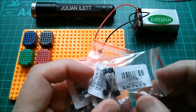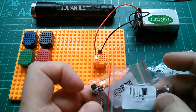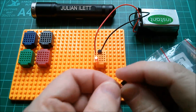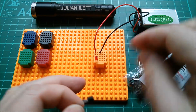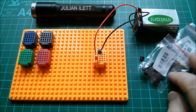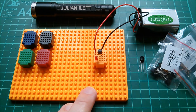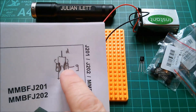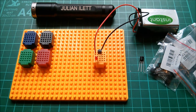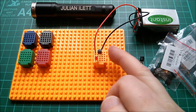I bought three types of JFETs: some 2N5457s and some J201s, because I thought they might be slightly different. One thing I noticed about the J201 — putting it in place of the 2N5457 — is that it has extremely low leakage from the gate through to the source or drain, through to that N-channel. The leakage across this PN junction between the P-type gate and the N-type channel is so low that I've sat here waiting for ages and the LED hasn't come on because that negative potential on the gate just sits there.